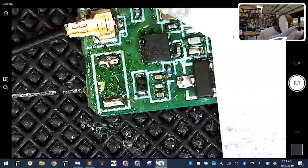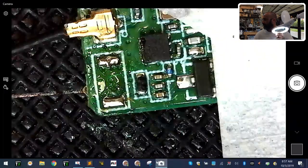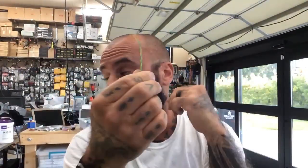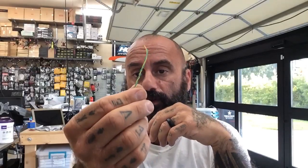Now we need to find some wire. I'm just going to grab any basic wire — it's kind of like the wire you get with the FrSky receiver. Grab any thin wire that has really good outer silicone protection, because the cheaper ones will just burn back as you heat up the wire. If you have extra wire that came with your FrSky receiver or any name brand product, use those.